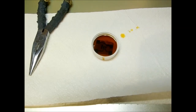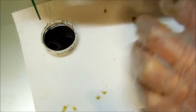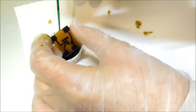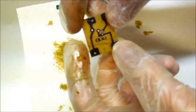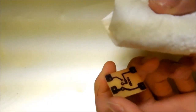It has been about 20 minutes and I have been agitating the board during that time. The board should be ready now. I'm going to rinse this off. I have rinsed it off and now I have some rubbing alcohol to wipe off the Sharpie, revealing the nice shiny copper traces.